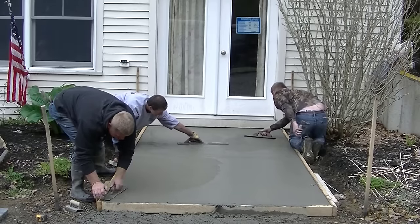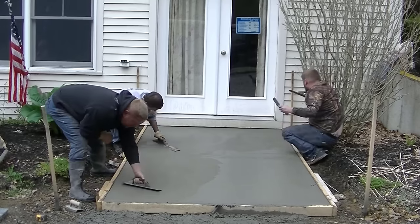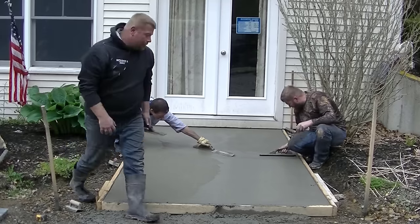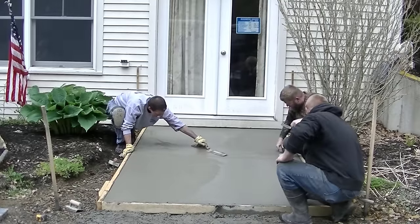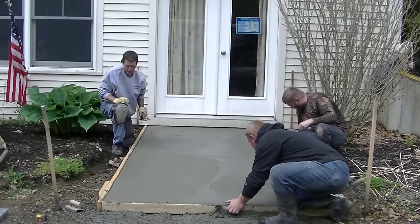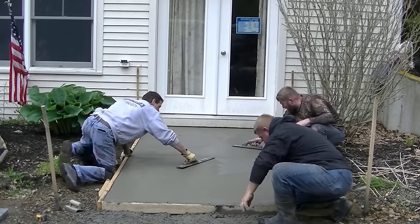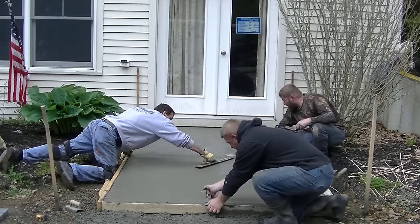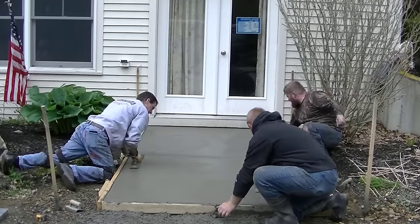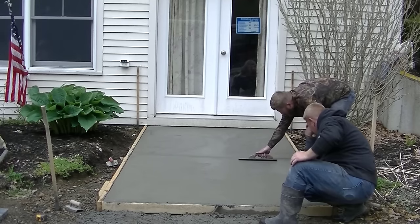I want you guys to tell me in the comments below — do you think pouring a little slab like this is difficult using wet poured concrete, whether you're going to use a bag mix or ready mix concrete, versus dumping dry bags of concrete in here, leveling it out, and trying to get a nice finish on the surface? I don't even think you can get a broom textured finish with a dry pour — you'd basically just be brooming off the fines of the surface and exposing the aggregate again, so I think that's out of the question. You can see it's not much effort to mag float the surface and work up some really nice cream on the surface so you can get a broom texture on it.